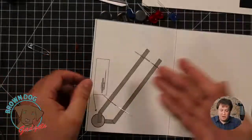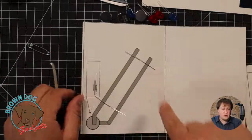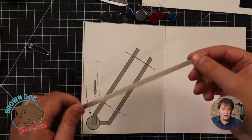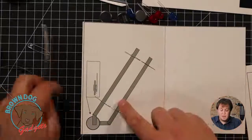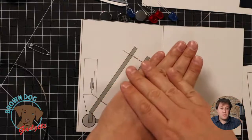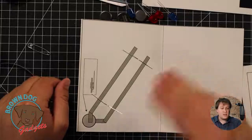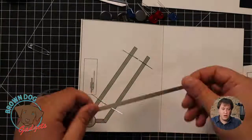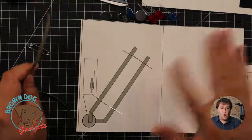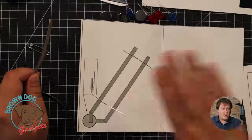But there, that's it. I put all this on here. Life is good. And now it's adding tape. If you're doing this with regular copper foil tape, copper foil tape isn't always conductive on the bottom, not like our awesome nylon maker tape. If you're using copper foil tape, put down a layer of copper first, then the LED leg, and then another piece of copper foil on top to get it down, because typically the top of copper foil tape is what's conductive, not the sticky underside. Our tape is really awesome, and it's conductive on top and bottom through the stickiness. Copper foil isn't. That's the only modification you have to do with this. Or just use a regular clear piece of tape just to keep that leg down on top.